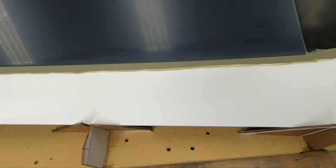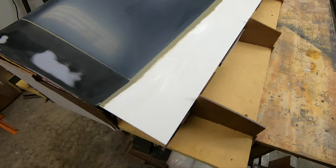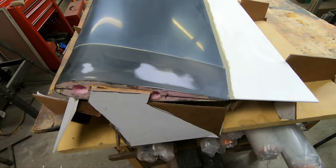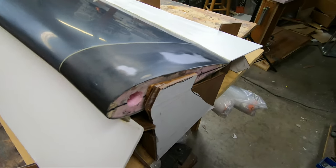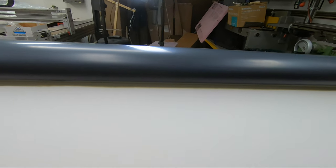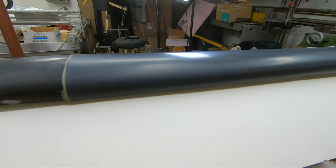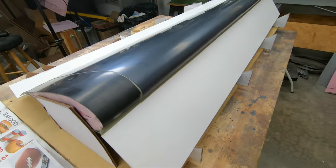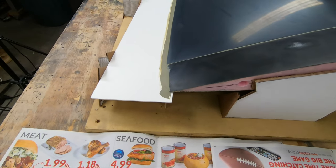Here's a little tour of what it looks like at this point. I've got plasticine on here around just about every edge, on the ends, and in that little gap between the plug and the plug extension. Right at the very end you can see how I kept the plug from slipping down — I've got a piece of wood hot glued to the end and then down to the baseboard that everything's mounted on. Here's the nose with plasticine underneath. At this point my plug is pretty much ready to use — it's time to start putting some fiberglass on here and make a mold.